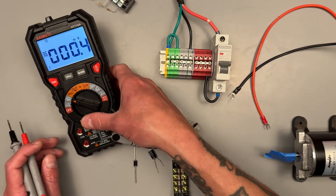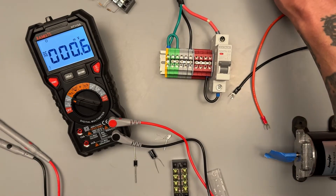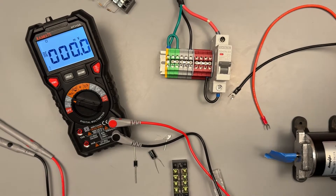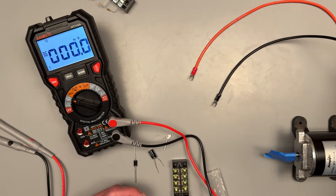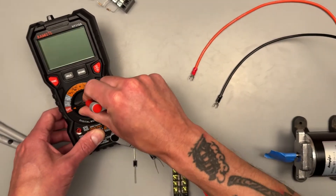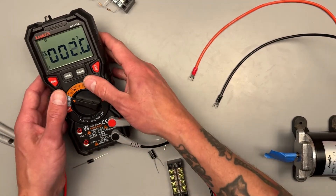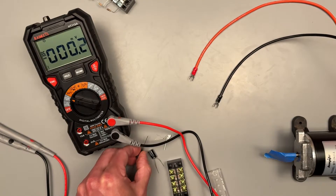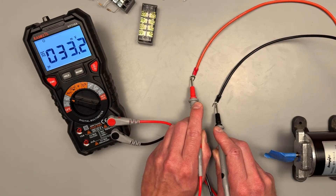Next setting — the lowercase 'm' as in 'milli' is for millivolt. I don't have a good millivolt AC source but I do have a millivolt DC source. I'll output about 50 millivolts and see what comes back. We're in our millivolt setting for DC — it blinks to remind you about port leads. Your black lead will always be in COM; it's your red lead that hops around. It's a nice big bright display. It's saying 33 millivolts and I'm outputting 50.